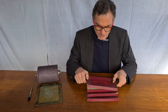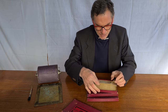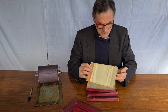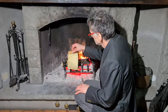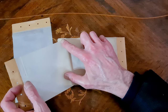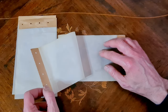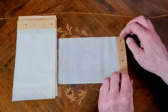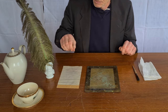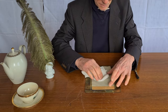Let's try to do some copies with this mimeograph. First of all, I have to prepare the matrix. I will use the original waxed paper from the 1920s. After so many years, the wax covering the paper has melted and the sheets are stuck together. I will try to separate them with heat — since it's waxed, it should work. Very carefully and very slowly. I managed to separate some of them. Now I will prepare the stencil by writing on it. The waxed paper should be placed on the writing plate, and I smooth down the stencil so that it clings to the plate.